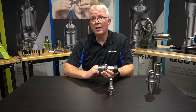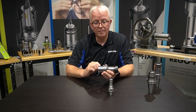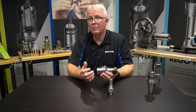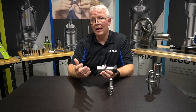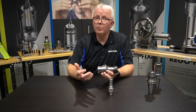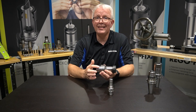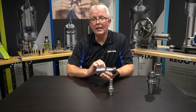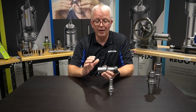You can pick the manufacturer you wish to work with, but most chips will glue right in there with the proper epoxy. What about holders that don't have these? There are some series that don't have them, or manufacturers that haven't added them. That should be something you can ask the manufacturer you're getting your tools from — tell them you need that RFID pocket for future growth. They should be able to put that in at no charge or very minimal cost with minimal delay.